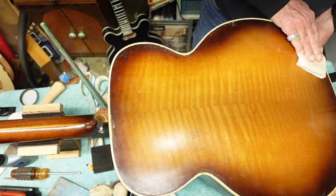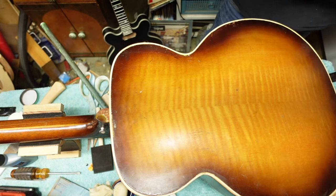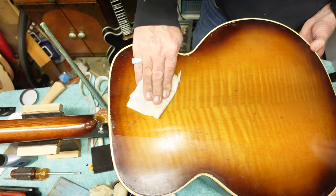When you're doing this for real with the French polishing pad, you'll find that you can do three or four coats a day. This is how they used to do violins - it would build up really thick and it will protect everything.